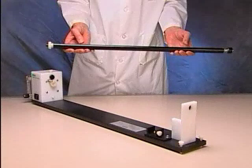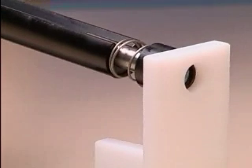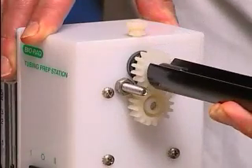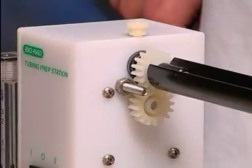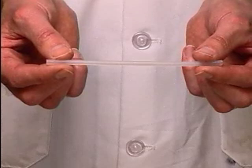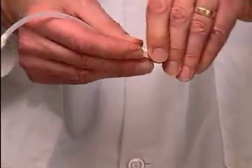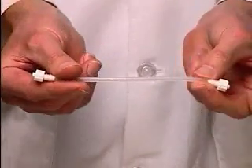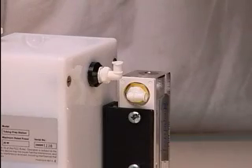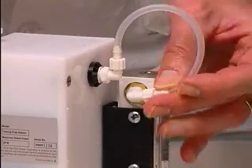The tubing support cylinder is inserted into the base. Check that there is an O-ring in the stainless steel end. Insert the end with the spring into the hole in the support bar. By compressing the spring, insert the other end into the motor housing. Cut a 4-5 inch piece of syringe adapter tubing. Attach the barb of a luer fitting to each end of the tubing. Attach one end to the side of the motor housing and the other end to the top of the flow meter.